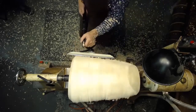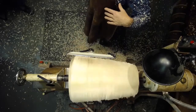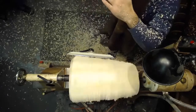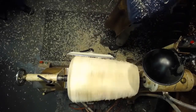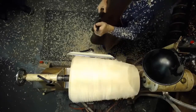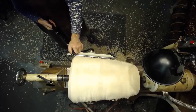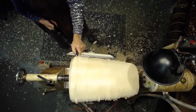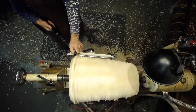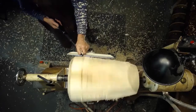I think it's interesting to see the bark was on the outside. There are actually a couple of them over near the door that are the whole log. What I didn't describe is that I used a chainsaw to cut corners off of it to make it sort of an octagonal cone. It saves a little bit of time at this stage, but the main reason I do that is to get an early glimpse of what's inside the log.